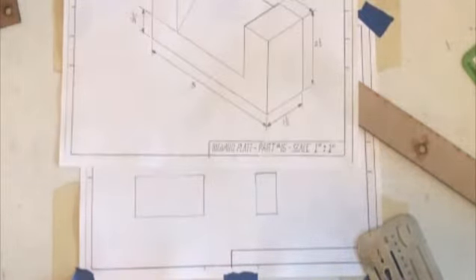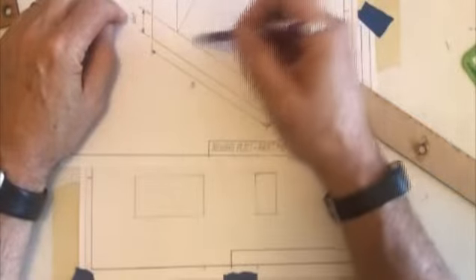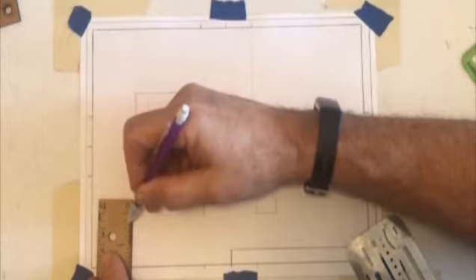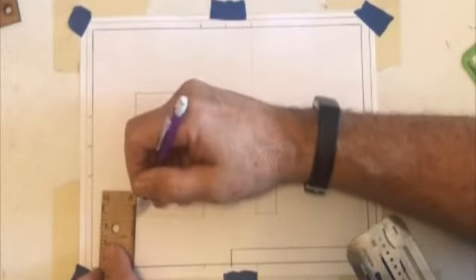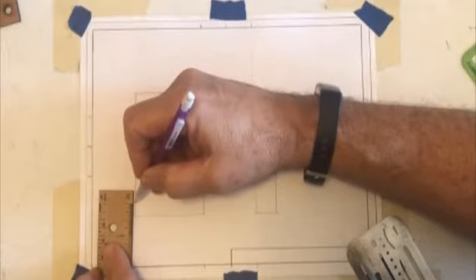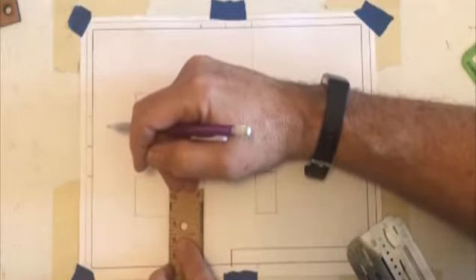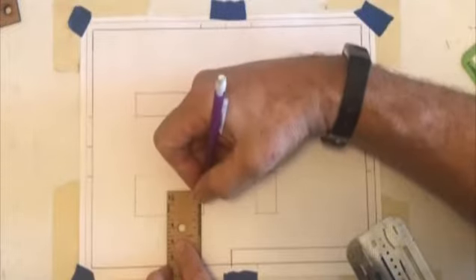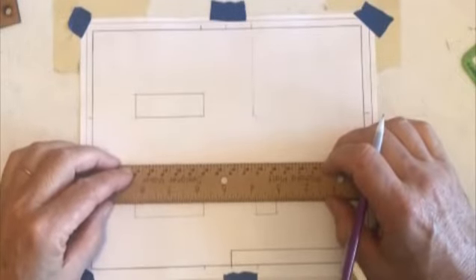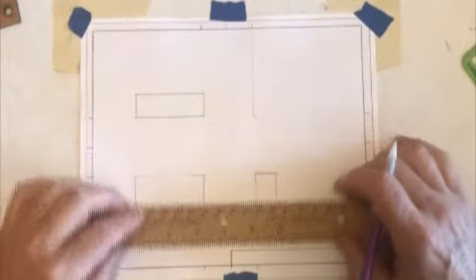Now, let's look at this part. It says this bottom edge of the slanted surface — the slanted face — is three-quarters of an inch. So half of three-quarters of an inch would be three-eighths of an inch. We'll take our ruler and find three-eighths of an inch: one-eighth, two-eighths, three-eighths. I'm going to come up and place that mark right there. Then I'll transfer across to the other side and do the same thing. I'm just going to take this ruler and, as the old saying goes, connect the dots — draw all the way across this drawing.